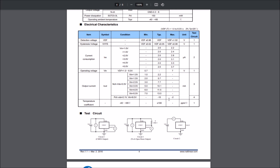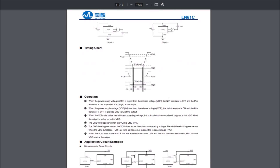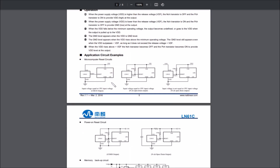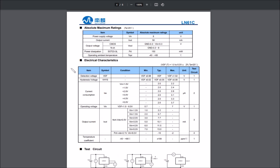Reading more about this device, you realize its main use is to detect that VCC is falling and signal to a microcontroller. These are microcomputer reset circuits — they signal to the microcomputer that VCC is falling and that it should either reset or respond in some way, perhaps going into a subroutine to back up data, because power is disappearing. That was its intended design purpose.